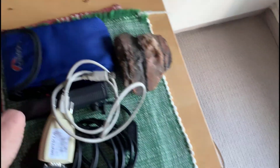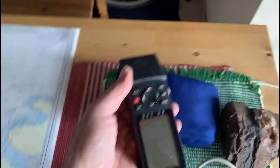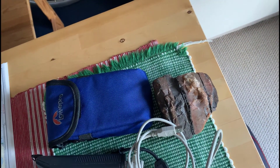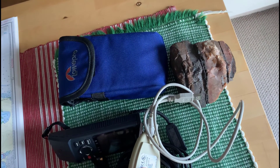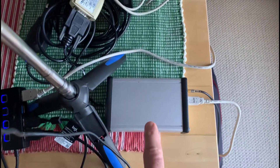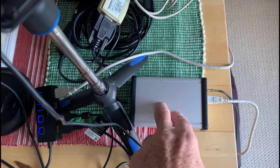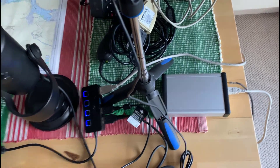Here's my older GPS receiver — this is a Garmin GPS 38. Still works really well. It's got a serial connector on it. Unfortunately it's RS-232, and this is an RS-232 to USB adapter again using the FTDI FT232 chip. The problem with those chips on the Garmin and on the Lassen is that when you go into Windows 10 it doesn't recognize that chip. Hard to believe — it's one of the most popular chips around for virtual COM ports. Anyway, we can get around that using Linux, so that's what we're going to do.